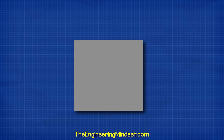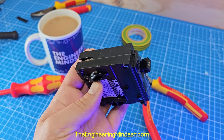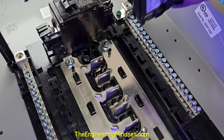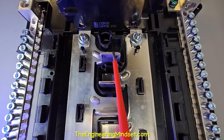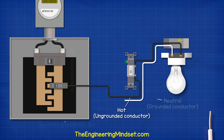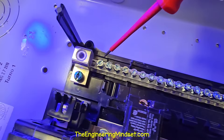The panel will provide power to different branch circuits for lighting, receptacles, air conditioning, etc. Each branch circuit has a circuit breaker which hooks into the casing and slots onto the protruding metal plates of the bus bars. We can place them on either side — the top slot on either side connects to hot bus bar one, whereas slot two connects to hot bus bar two. We then run a hot wire or ungrounded conductor to power the load, for example a light fitting. The white neutral wire or branch circuit grounded conductor connects from the fittings and goes back to the neutral ground bus bar.